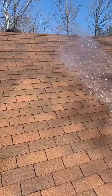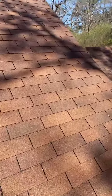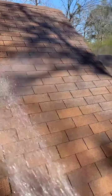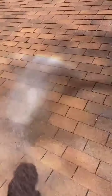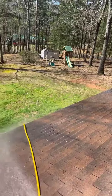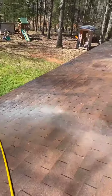I'm running about 100 PSI on my gas roof pump — that's all you need when you don't want a lot of runoff. Now if I'm trying to reach from the ground I'll turn it up, but on this roof it has a front porch so I can walk all the way across it, no problem. All I'm doing is a light mist across this roof. That way I'm not having a bunch of runoff.